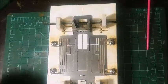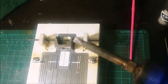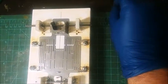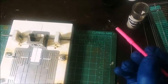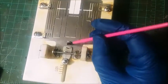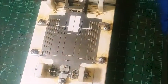All right, so let's talk about soldering here. I like the Hakko FX 601 with a 1/4-inch chisel tip. You want to find a decent quality acid flux. I usually fill up just a little cap on my workbench here, and I like to use the dollar store brushes rather than squeezing it out of a bottle. It just turns into a big mess. With the brush, I can really kind of control where I'm applying that acid flux, and it does a little bit cleaner job. So I'm probably going to start on the front end of this car.